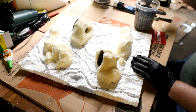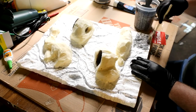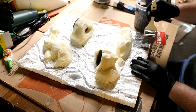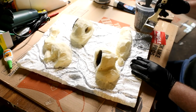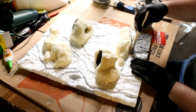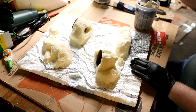And yeah, once you're done mixing your Drylock with the preferred color, you're just going to spread a liberal amount on the back. You're going to do this either 2 or 3 times, depending on how waterproof you want it to be. I, at the end, ended up with 2 layers on the styrofoam board, and that was totally fine for me.